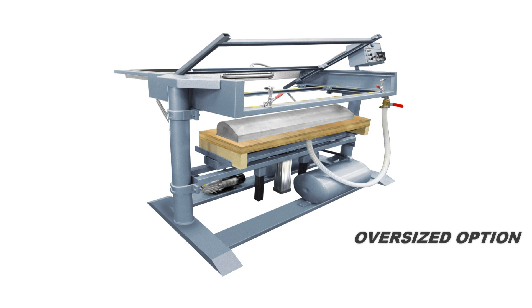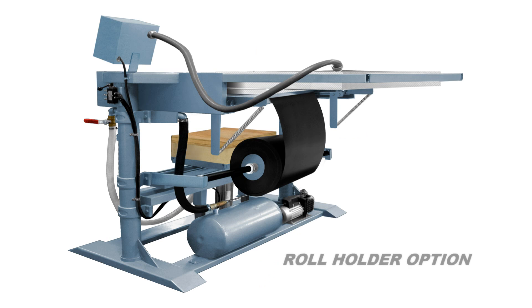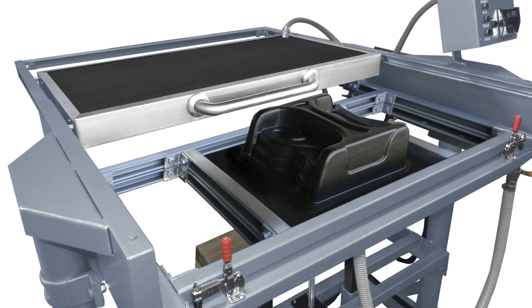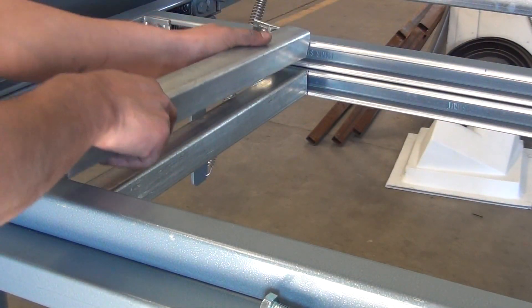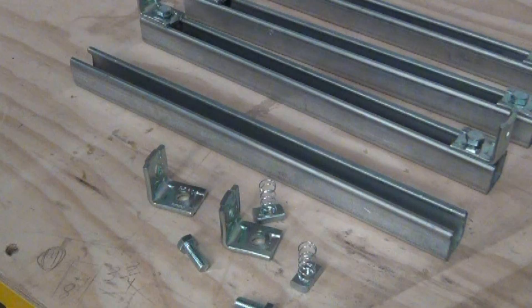Regardless of the options added to the BVC class 24x48, the equipment will function in the same way. Shown is the clamping frame. The clamping frame can auto adjust to any plastic thickness anywhere from ¼ inch down to 20 thousandths or thinner. The clamping frame can be quickly and easily sized down to any configuration by the use of standard fastening strut and self-aligning brackets which have been provided.